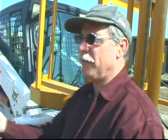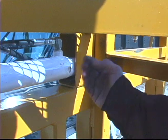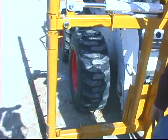What they were doing was trying to run the Insulink machine with the fabric dropping into the hole — the trench. The problem was they couldn't get close enough to the trench without caving it in. If that was the case, we have two different operation settings on the Insulink Junior. Just by moving the pin back you can get an extra six inches of gap. Right now it's set up for the furthest from the Bobcat — about 18 inches at the most. He may have done that and felt it wasn't enough room yet.